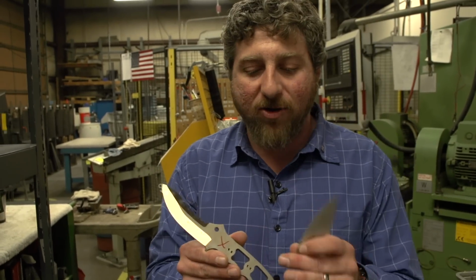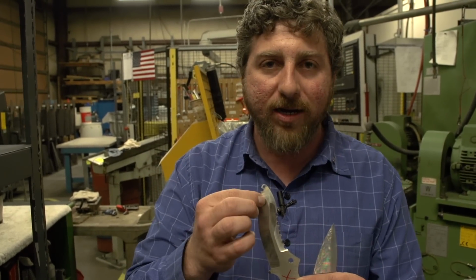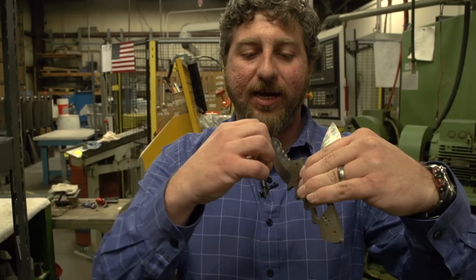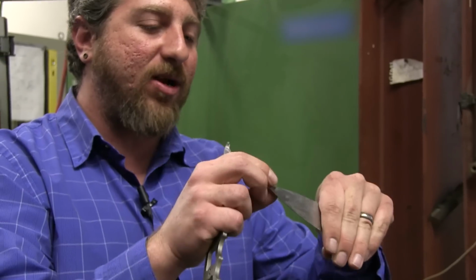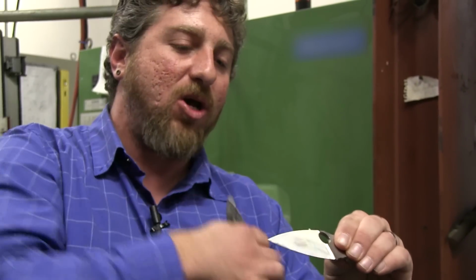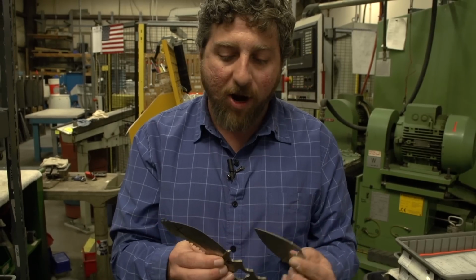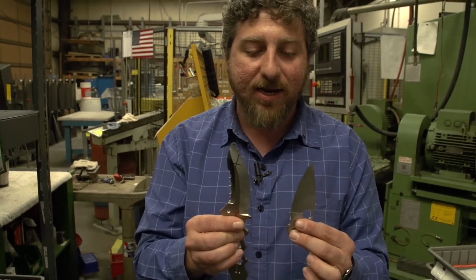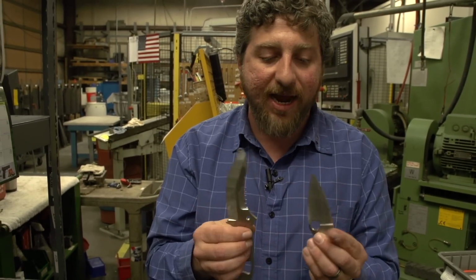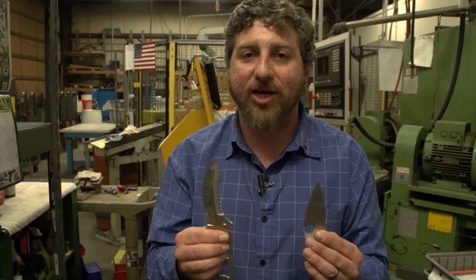In our facility, we do two kinds of bevel grinds. A bevel grind that I'm talking about is that main bevel. This one is a hollow grind where a round wheel comes in and creates the round dish of what the hollow grind is. The other type of grind we do is a flat grind where a large wheel comes in and does the full flat grind. And so we pride ourselves in our bevel grinds and making the parts flat and clean from the beginning. And so as the parts go on from this stage, it's easier and a higher quality as they go throughout the rest of the manufacturing processes.